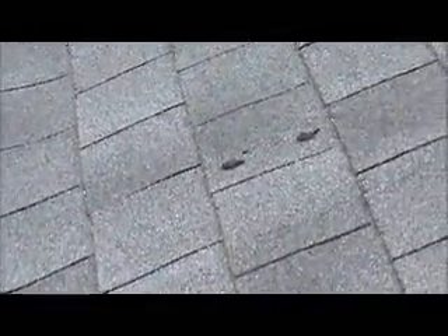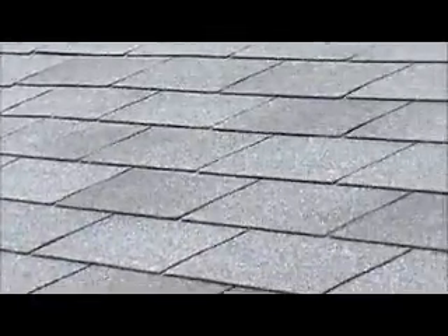And there's also a few shingles down here that have holes in them where they were caulked down on the gutter line, left side. So we need a new pipe collar, reflash a vent laundry vent, and replace a few shingles down on the gutter line. Also right here there's shingles with two holes in them — they need to be changed.